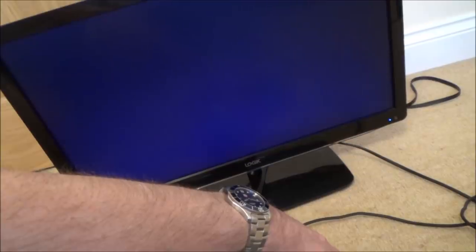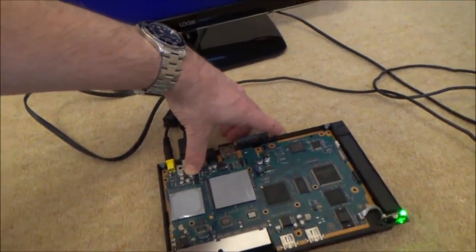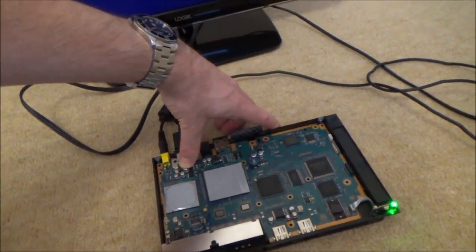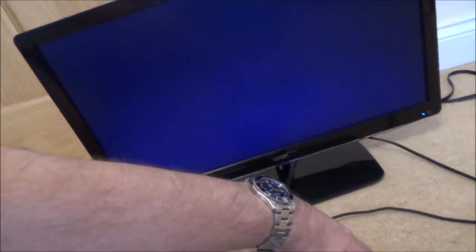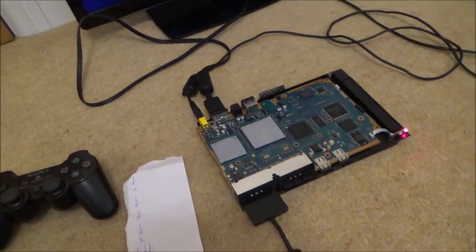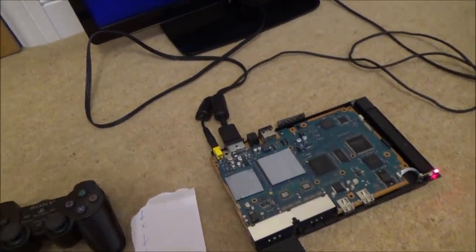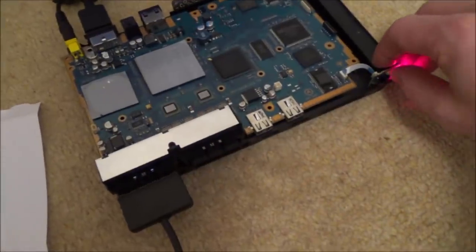Right, do you know what I'm thinking now? I mentioned RGB earlier, and I'm pretty sure when I was looking up videos before, one of the issues could be, if this was last on RGB, I need to double check this now, if that was last on RGB, then I'm not sure if it displays or not when it's on AV. So it could be just a setting issue. I tried it on my one, and it doesn't make a difference whether it's on the RGB or the other one, the YPR, whatever it is. But I have written down what the combination is on the internet.